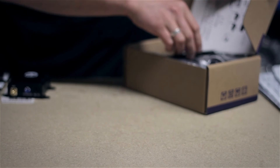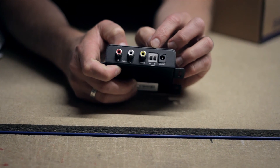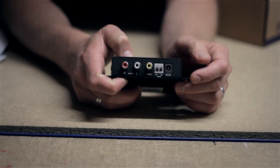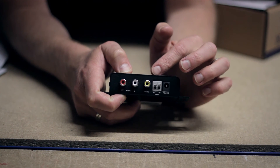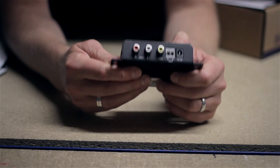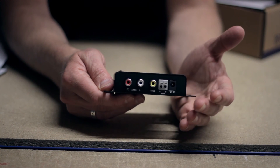We also have one that will control a pan tilt zoom camera. In addition, you've got an RS485 connection for the controls for a pan tilt zoom camera. So if you've got a pan tilt zoom at 150 metres, you can run the telemetry, the video, and audio if you've got it. It uses the same digital technology so that they pair up together with very little problems with interference.